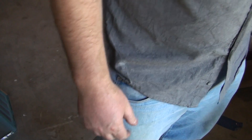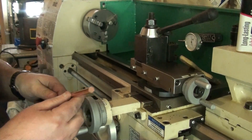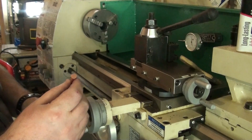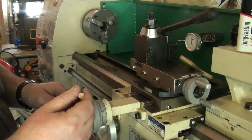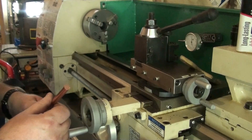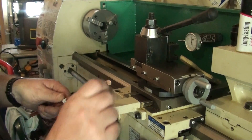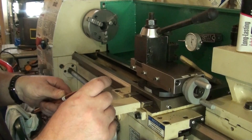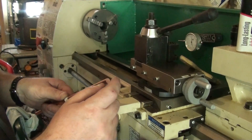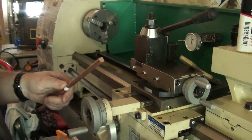It's one of two. I'm going to face the ends of the rods here and insert a screw thread. That's where our tips are going to be. I'm going to bend these about 90 degrees — hopefully 90 degrees — and then we're going to screw the tips in there, which we've got to make as well.